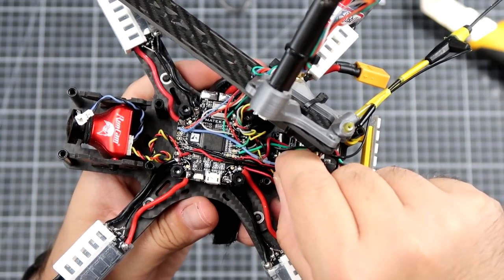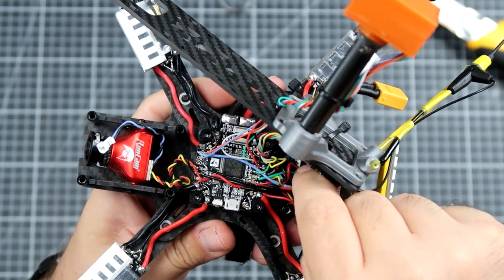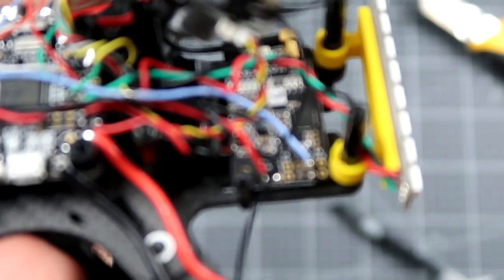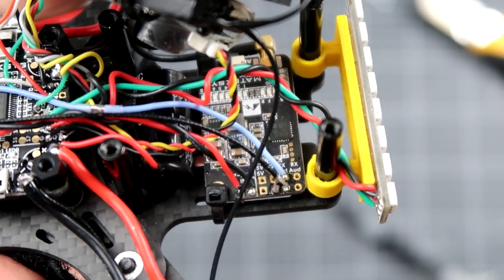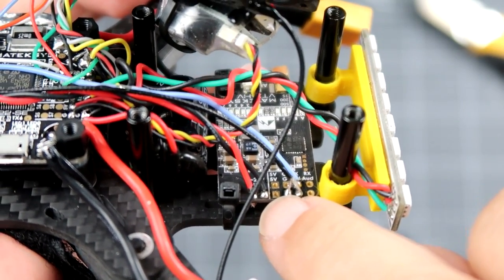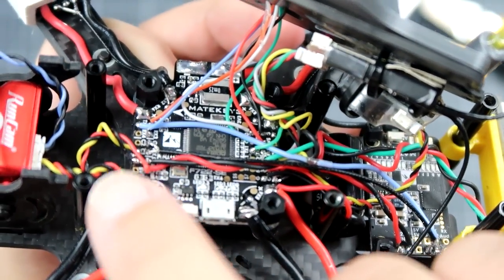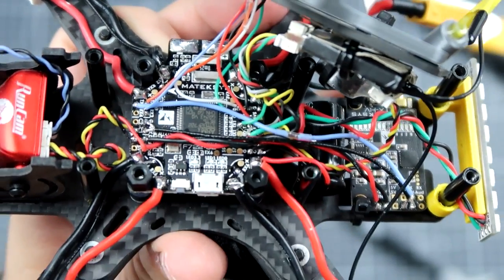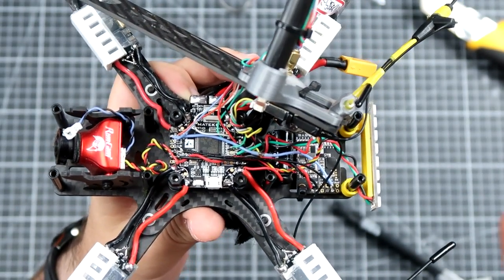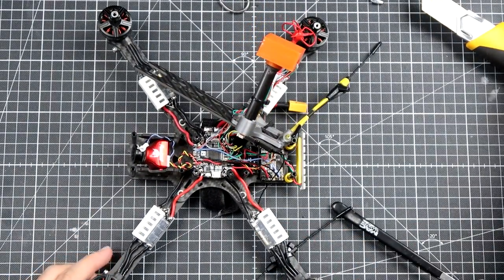So what I did, I just used over here this wire, which is a coax. This one over here, you see? Maybe it will be nicely visible if I zoom in some more. You see over here, it's a coax. It has a shield, it has the signal, then this thin coax goes to the output on the flight controller, and guess what? The noise is gone.